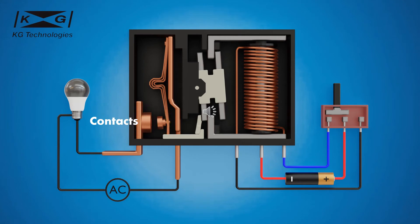The latching relay contacts are made with silver tin oxide over copper. Silver tin oxide is a non-toxic, RoHS compliant material with high welding resistance and arc erosion resistance.